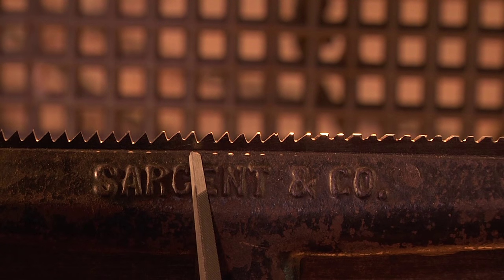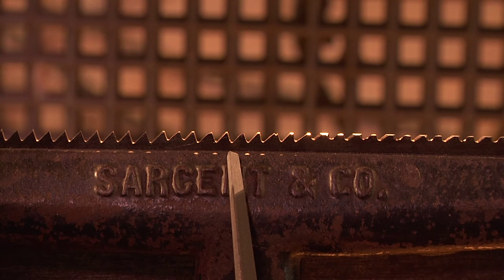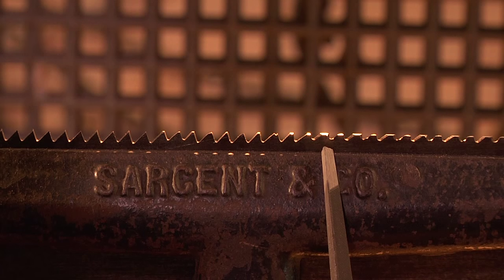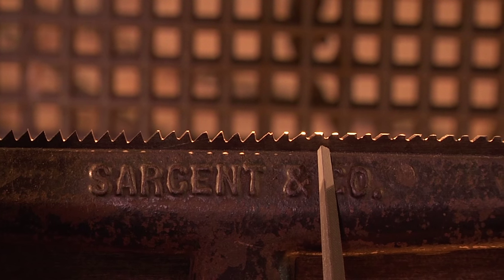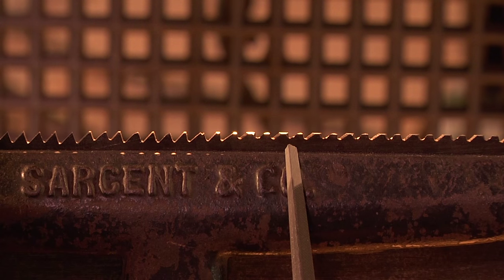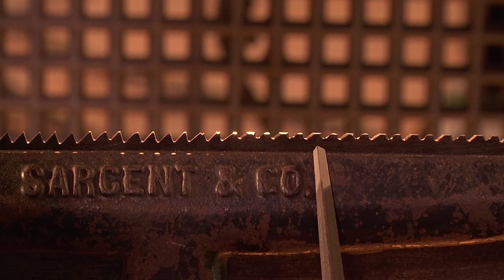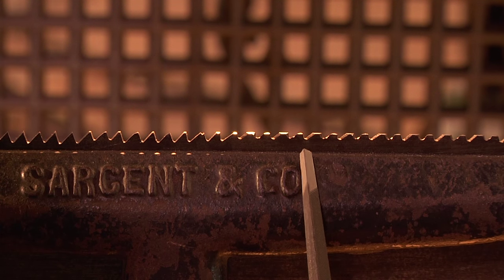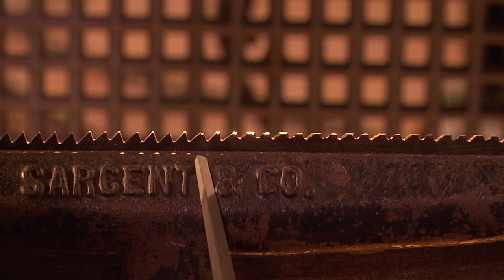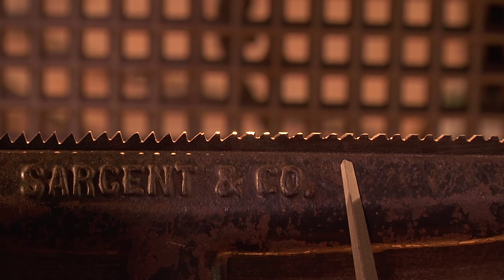As you get going down here, you can see that these teeth aren't anywhere near as deep — these haven't been filed. And as you get going down even further, look how bad the spacing is. You see the big gigantic flat spot on the top of this tooth, and then on the top of this next tooth. And yet this one is very, very small, then another big large one. That's all to do with how it was filed last time — pretty horrendous. So we're going to go right through on one pass and straighten that right back out again.